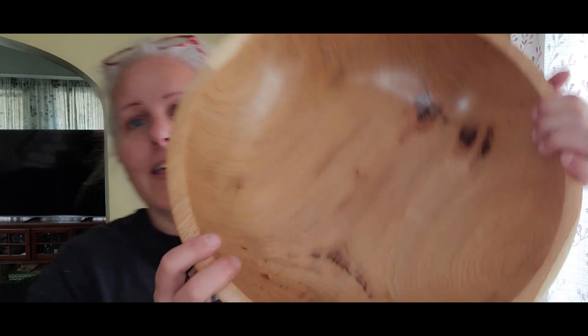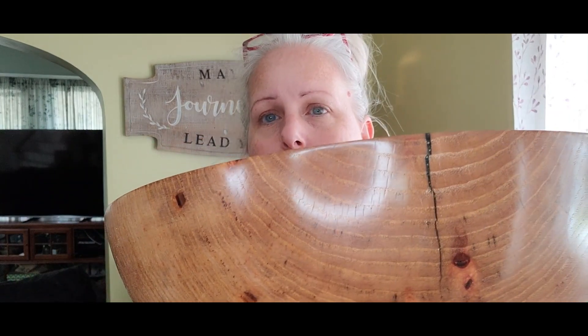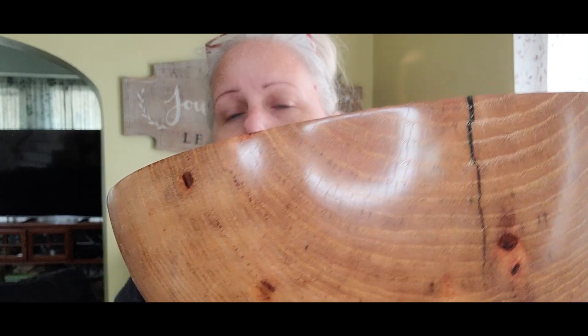He said to try tap cons because they go into concrete, so of course they're going to be strong — but not in coffee wood. Like I said, I pre-drilled the holes and they just broke off. I'm definitely going to look into different screws for holding my faceplate on; if I have to try every one on the market, I will — because that was just a headache. Anyway, I'm over it! Without further ado, here is the bowl — it turned out really nice despite all the headaches. It's filled with Star Bond; I filled those big cracks off camera before I even started turning, but I did fill the bark inclusions on camera.